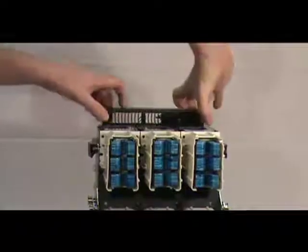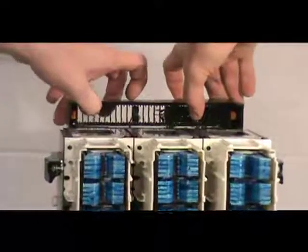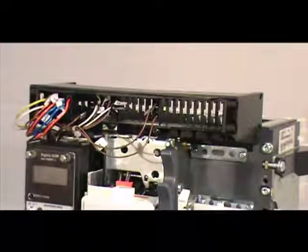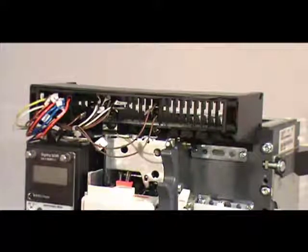In this section, we will demonstrate how to remove an under-voltage release, a shunt trip, and an overcurrent trip switch from the left accessory tray. First, push the two orange buttons and release the secondary mounting bracket. With a pair of needle-nose pliers, squeeze together the two release tabs found on the back of every connector and pull. This will allow you to remove the lead from the secondary mounting bracket.